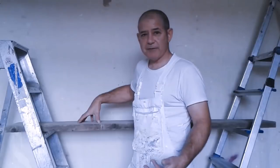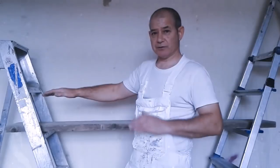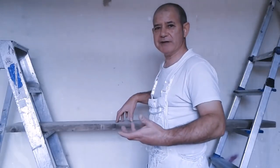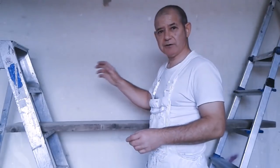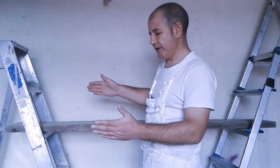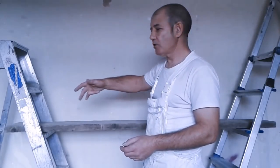It also depends on what weight you're carrying. If you're heavy build, then using a plank of say eight foot will have quite a bit of flex in it and maybe a risk of it cracking. So you could opt to use staging — trestles and staging — like a Youngman board, where you're looking at possibly half a meter wide and maybe seven meter span, so it can be quite big.